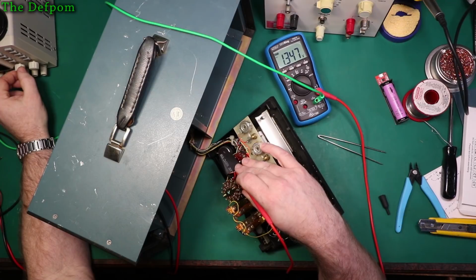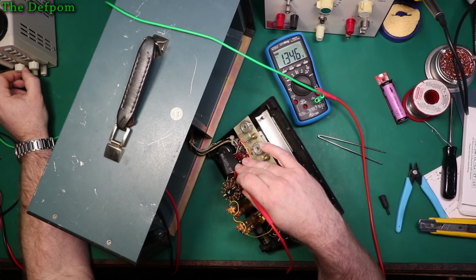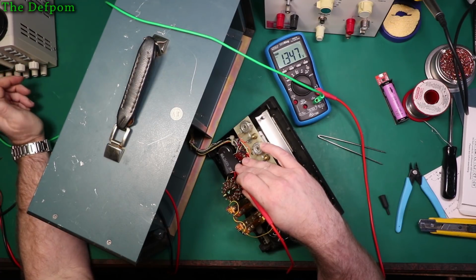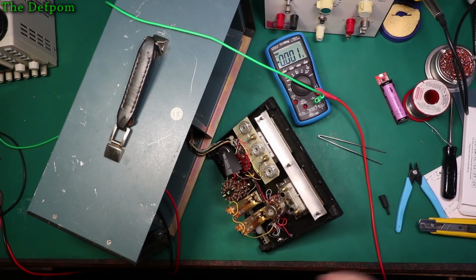Yeah, 2.7 volts is dropout voltage. So 1.4 above. So 3 volts lowest range is 1.35. So that's all tying in quite nicely, actually. So it's all working quite nice. If we go up to 4 volts, or 4.2 volts, which is the battery voltage, there you go, still 1.347. So all good, that will work.